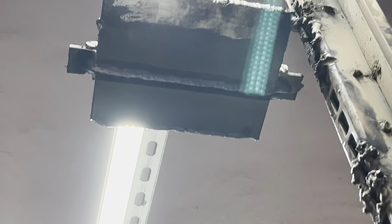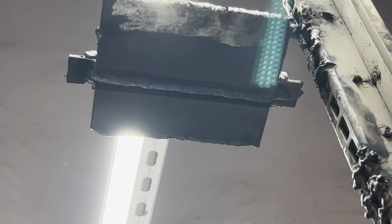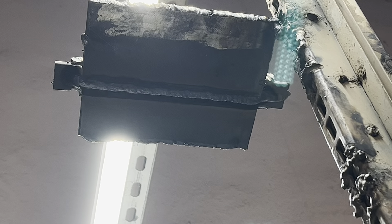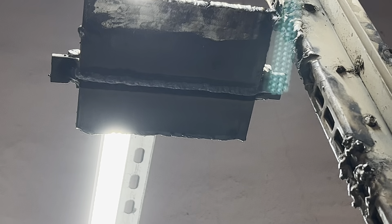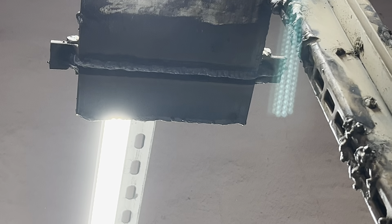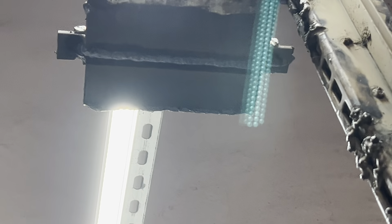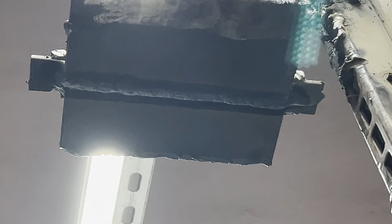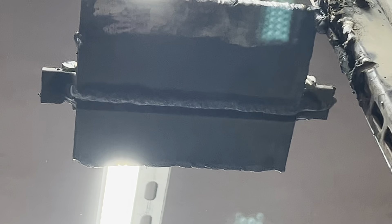Keep in mind, when you're running your cap you just want to run it kind of quick. You don't want to spend a whole lot of time on your cap with this flux core, because if you do, you can deposit too much metal — way too much metal. And as you deposit that metal, you'll notice that you've set yourself up for failure, because if you're not allowed to use the grinder, you can't knock it down to make it look smooth.